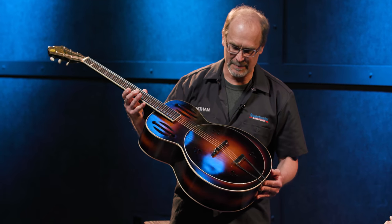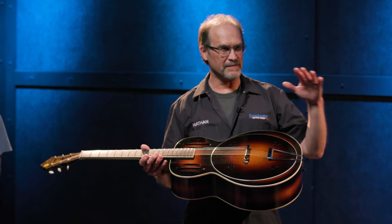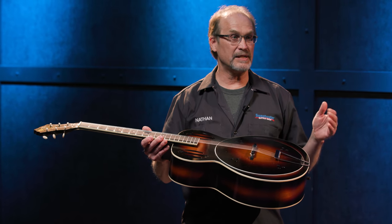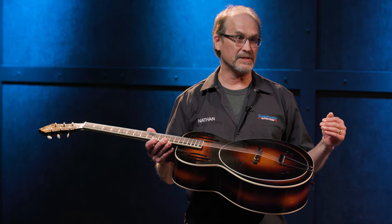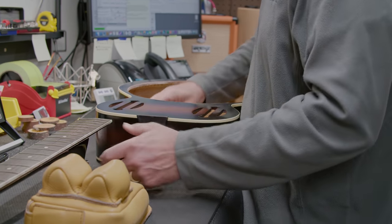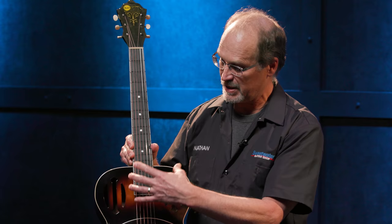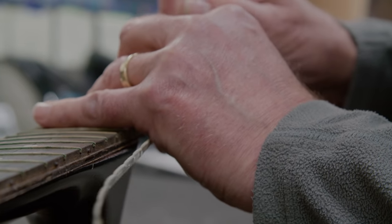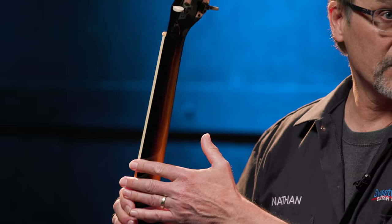Let me tell you some of the things that happened. Anytime an instrument comes into the shop, we do an evaluation of it. We check to see what the humidity level is, because humidity can really play a damaging part to an instrument. So when this guitar came in, I could tell that it had been really dry because we had a crack here — a very long crack in the middle. But the fingerboard had also shrunk from side to side, so we had a crack in the middle and shrinking on each side to the point where it didn't even match the profile of the neck anymore. There was a step there, making it really uncomfortable to play.